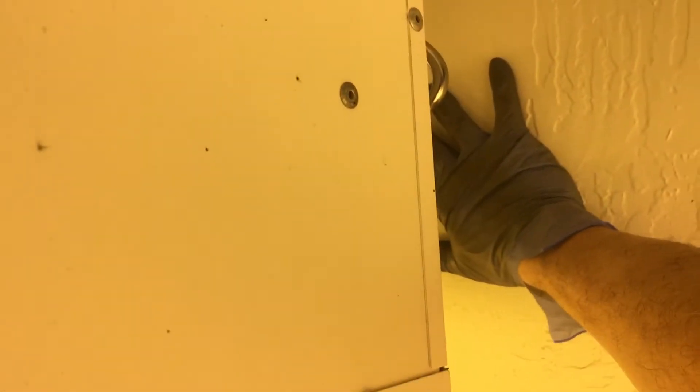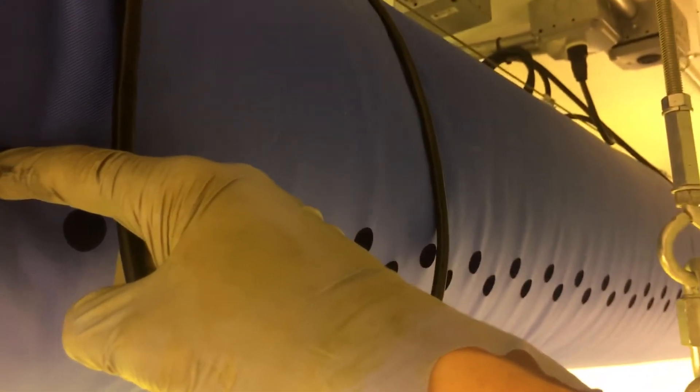Another issue: the exits come out the side and you're slammed up against a wall. You can feel this wall is like 120 degrees — the air hits it and mushrooms out, creating negative pressure that pulls some of the warm dry air right back in. So you spent all this energy drying air, only to re-circulate dry air back into the intake. You can't re-dry dry air, so you're burning extra power while removing less water.